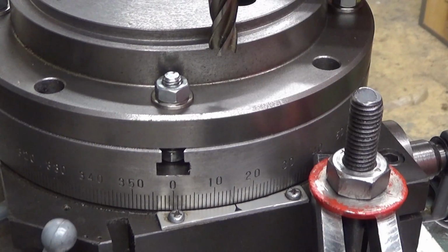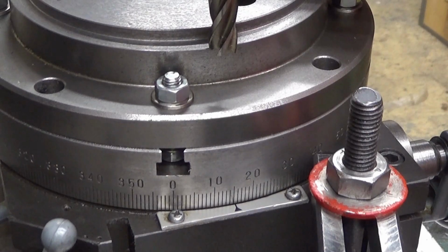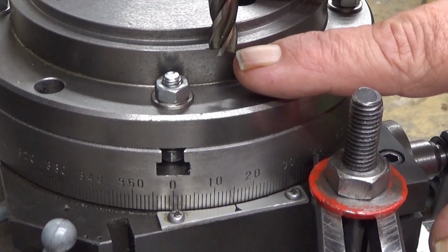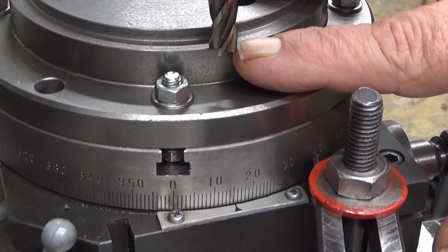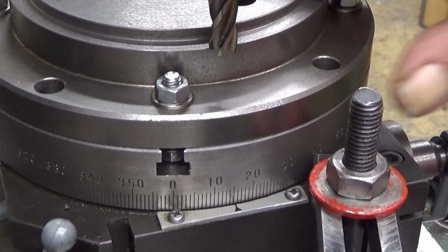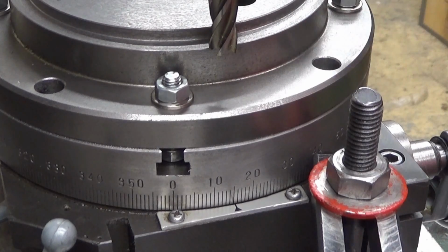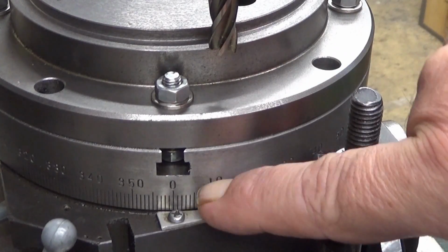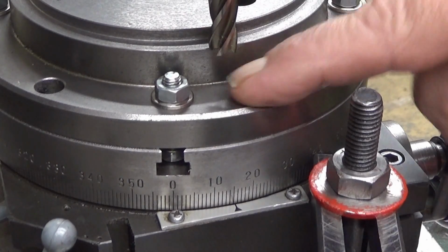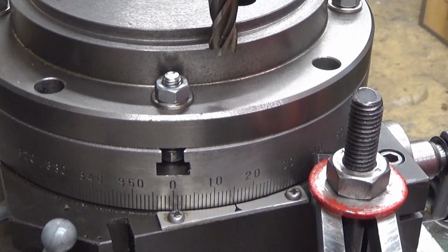So, now that we have the recess for the chuck, the place for the chuck, we need to have places for the mounting screws. And there will be 3 of them, 120 degrees apart. I'm using the rotary table itself for making the places. I cannot use this for drilling because we have the plate there under. But what I can do is pinpoint the places. So, let's do just that.